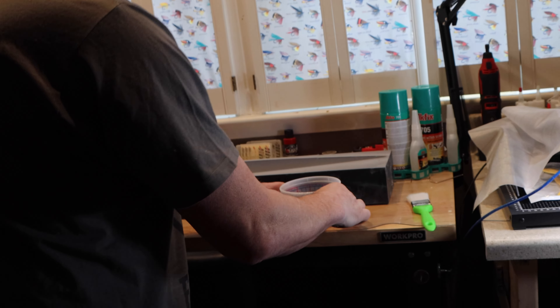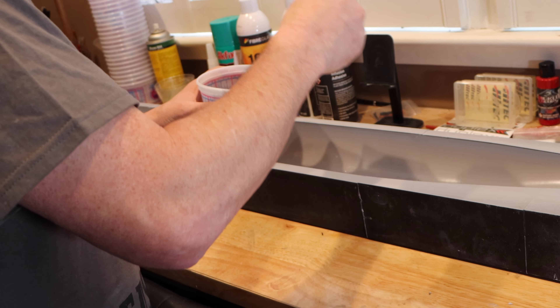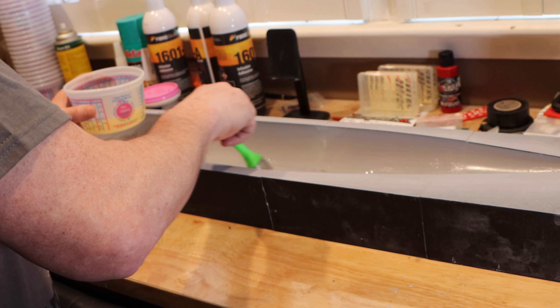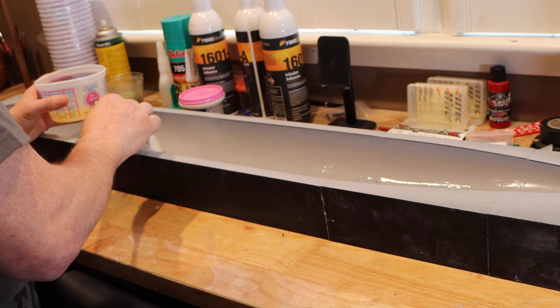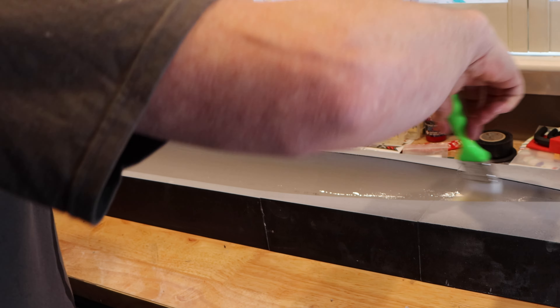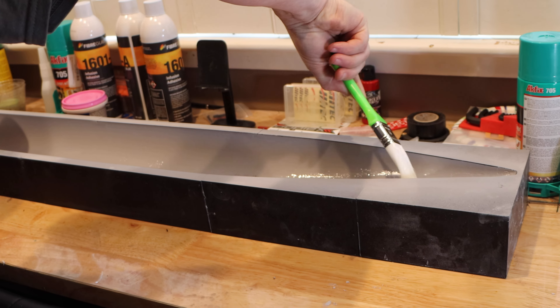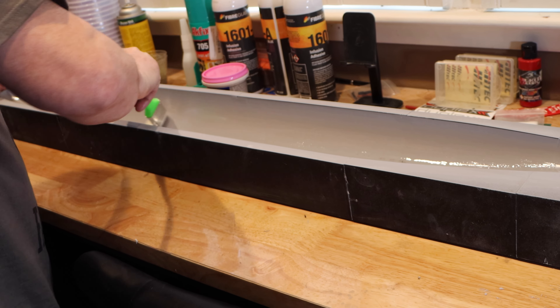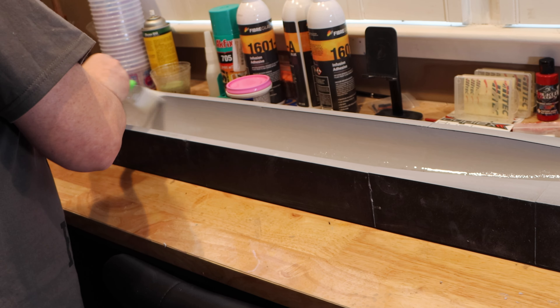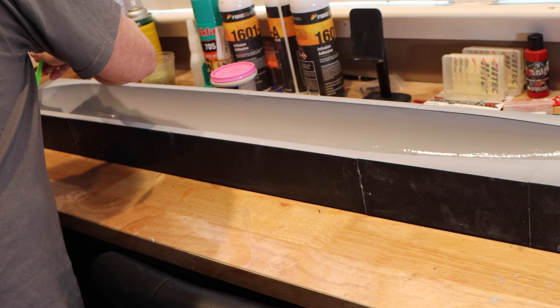The way I've been doing it: I put a thin coat of resin and hardener in the mold first, just kind of get it going, and then start laying on top of it. Use cheap brushes because it's one use — they're garbage after. Do not put too much on the sides; less is more because it just runs down into the bottom. The last time I did it, it was actually stronger where the epoxy was the thinnest.